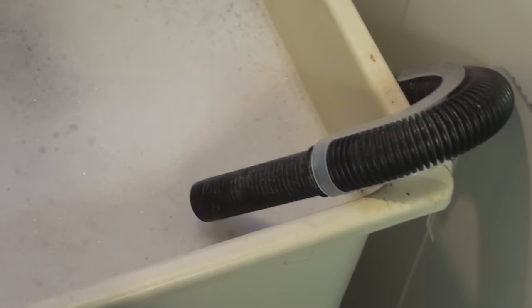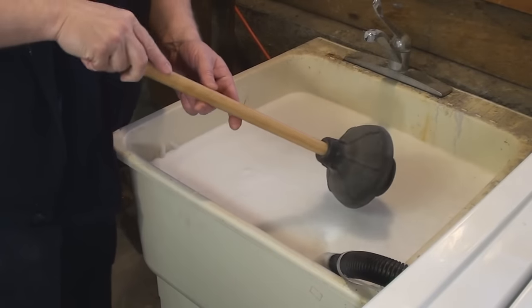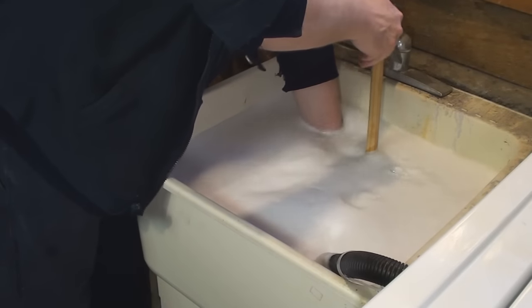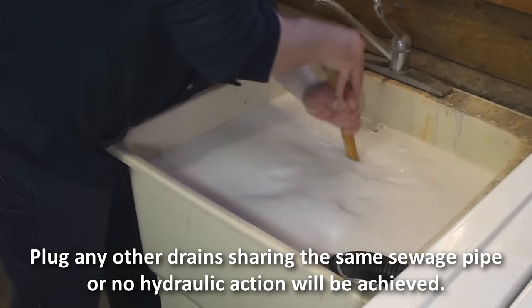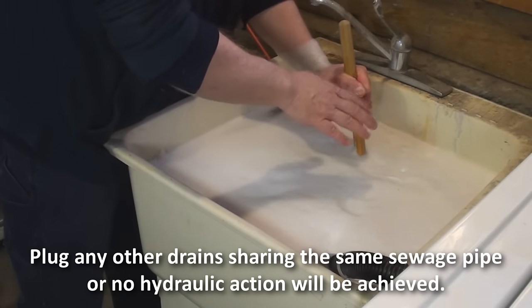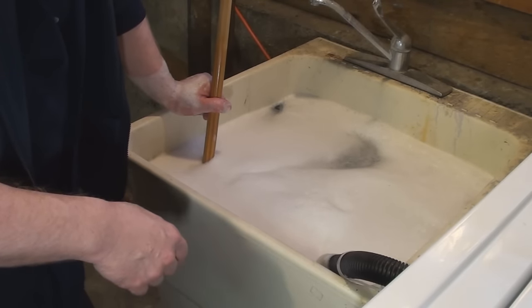I'm allowing the washing machine to vent into the sink, which allows for a build-up of what is otherwise just dryer lint that never made it to the dryer. That's pretty horrible. As always, the first line of defence is going to be a plunger — just getting in there and seeing if we can get a real good seal on it. The plunger is the first line of defence because it's the most eco-friendly choice, using hydraulic pressure to drive through your blockage. This is the second time I'm trying this and it's really not working out for me, so I'm going to have to move on to something stronger.